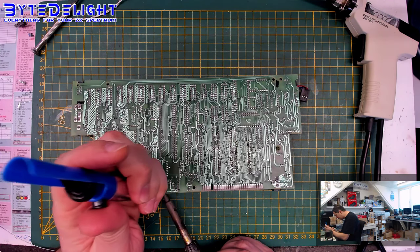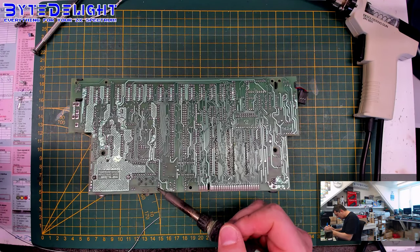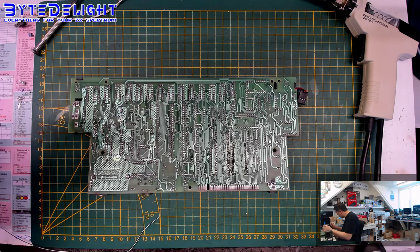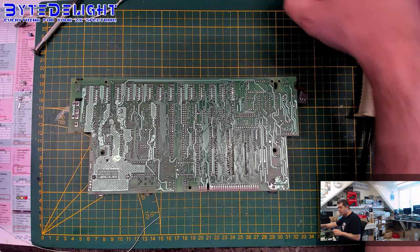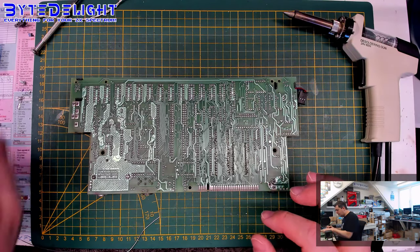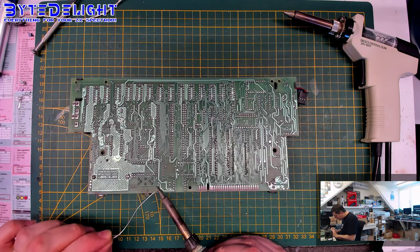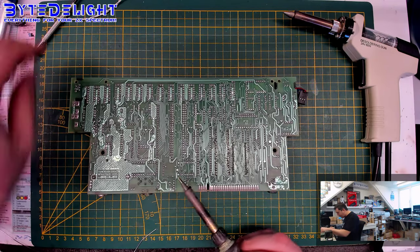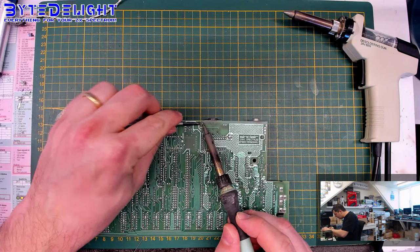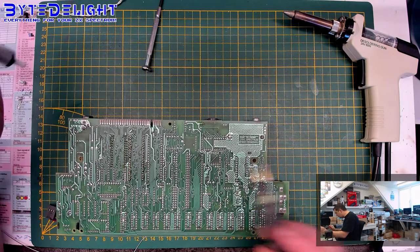But I do get it working, and the main issue is that the solder station that I use here needs about 10 minutes to heat up completely, because the tip is a part that is just sitting to the heating element inside the gun. So you really need to wait until it's heated up thoroughly. That takes some time. That's my experience. So if I wait a couple more minutes, might be easier, but for now we'll do it this way.